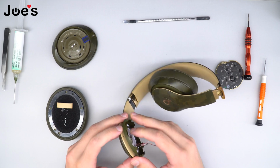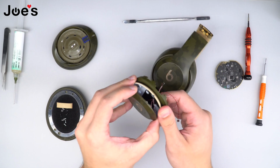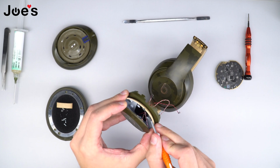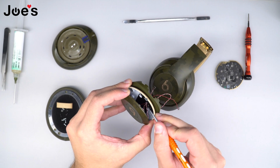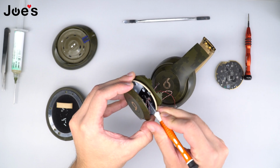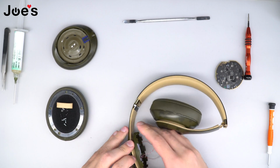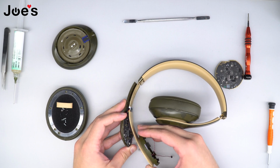And how I like to take off the panel is I like to split it and take the flathead and go in, because it is taped off there, and I just kind of like to agitate the tape and break it loose so that we don't damage the wires when we pull it through and remove the panel like so.